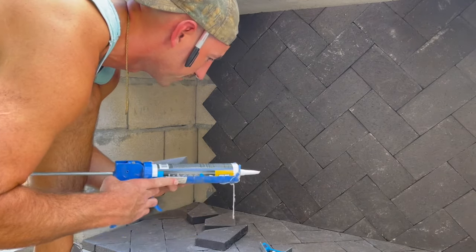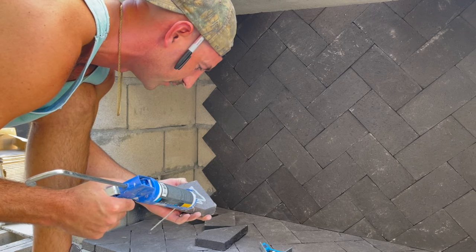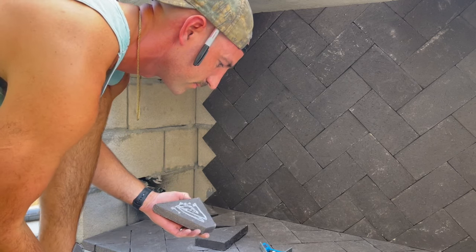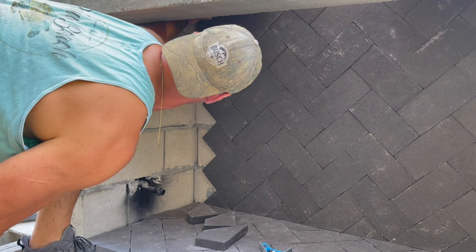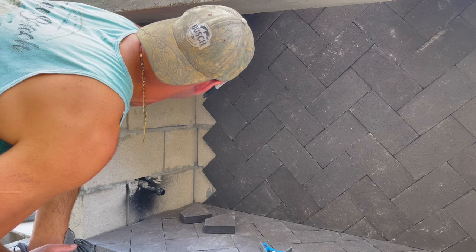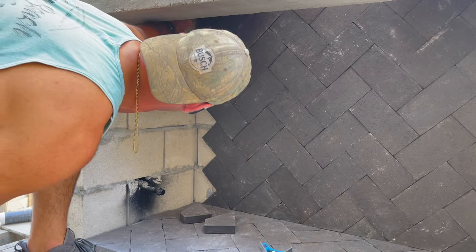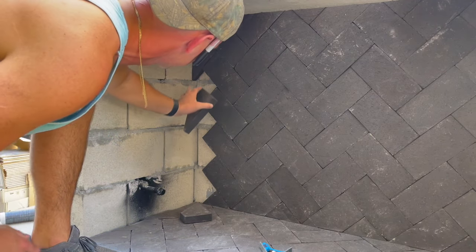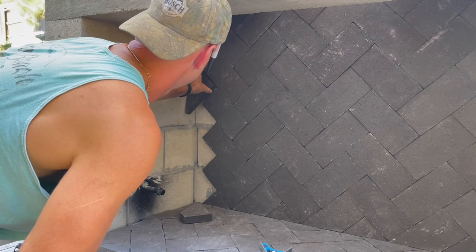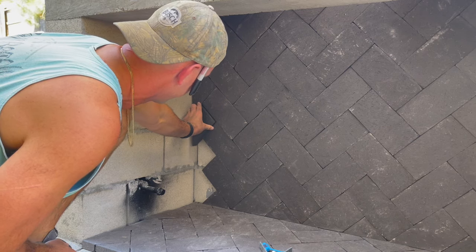So we're on the back wall, continuing the fire brick. When you gotta make these kind of unique cuts, it's somewhat challenging. Puzzle. Just make sure you're not gluing the wrong side, because I've done that. That would be no good. Coming out, you're gonna probably want a couple wood shims, something you could wedge in there to hold your brick. Dry fit them before you glue them.